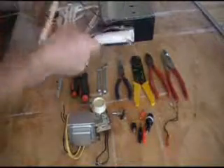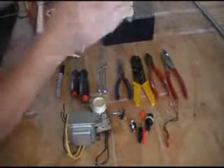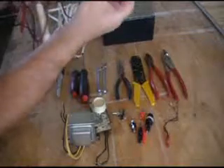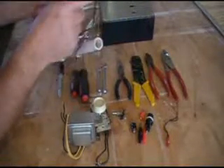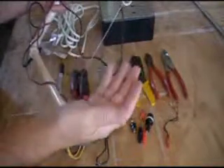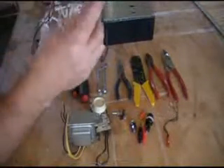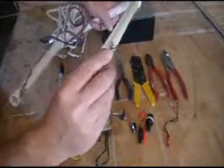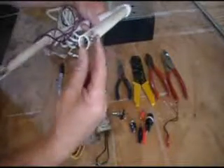Also a piece of wire — I've got some alligator clips to go between the wire, and some PVC pipe I had hanging around. The alligator clips are like $5 for a pack. This wire is welding wire I just happen to have, so it should hold up pretty good. The only thing is it doesn't really bend very well — it's very brittle. So what I did was I took a sixteenth inch drill and drilled a hole through these screws, then put a nut on there to hold the wire in.